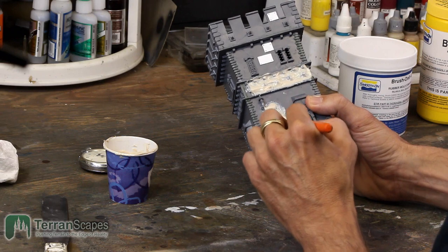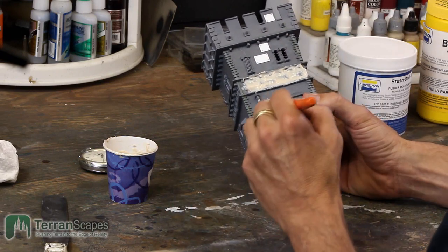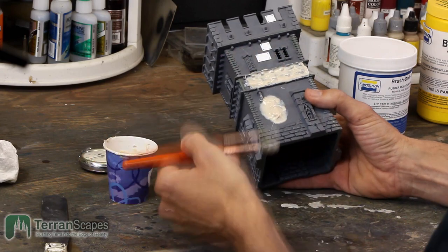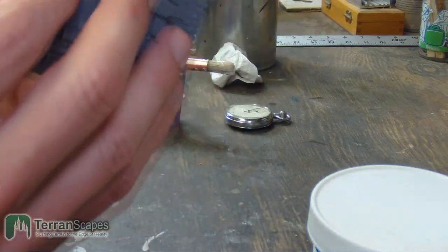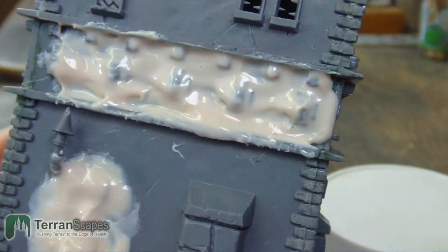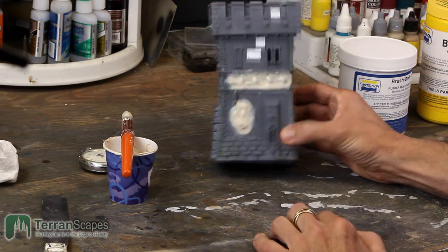This is actually not a tutorial about mold making — it's more about Brush On 40. Later, when I do a more detailed tutorial on mold making, you'll find out what makes what I'm doing here good or bad, and what other steps are needed. So don't take this as exactly what you need to do. You may also notice there are some air bubbles in the surface of the rubber — I haven't found those to be a problem. If you had a large mold and were risking your total pot life, you'd want to do a thin coat first, let it set, come back when it's tacky, then do the second coat.